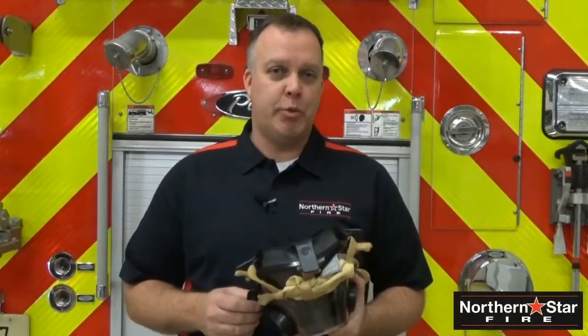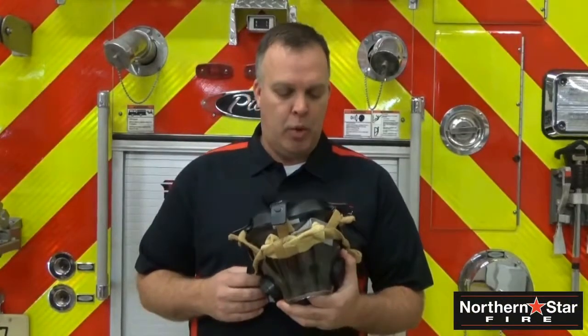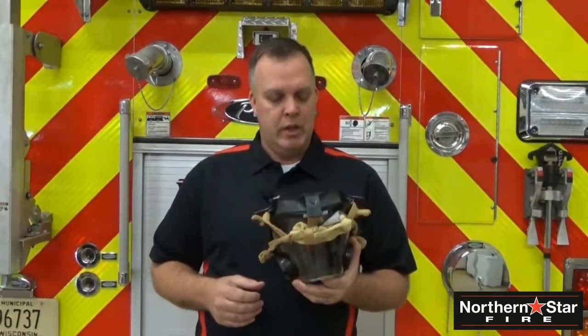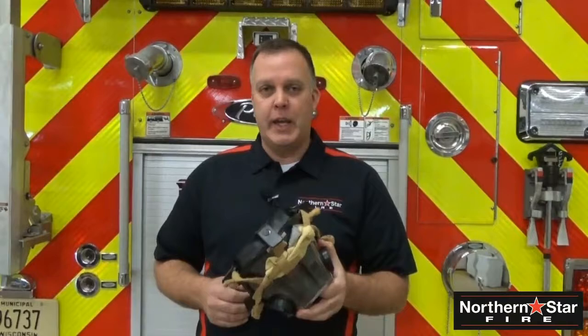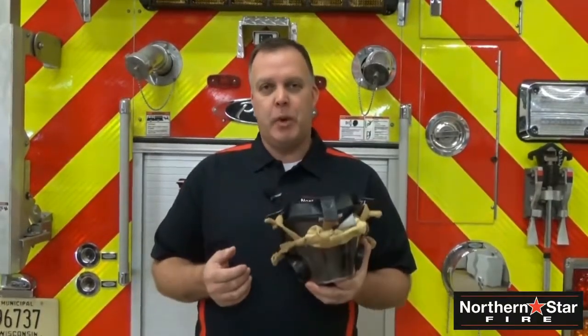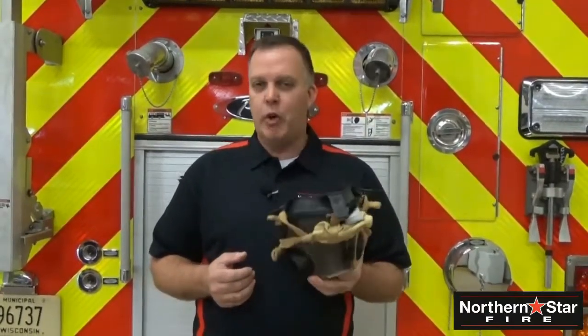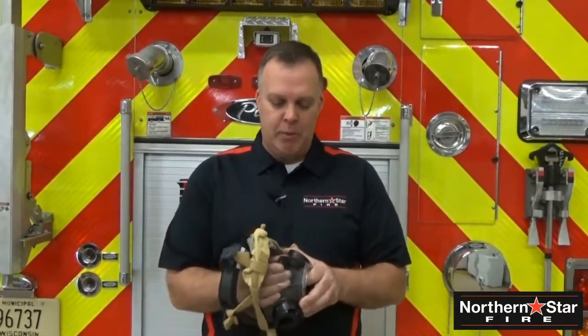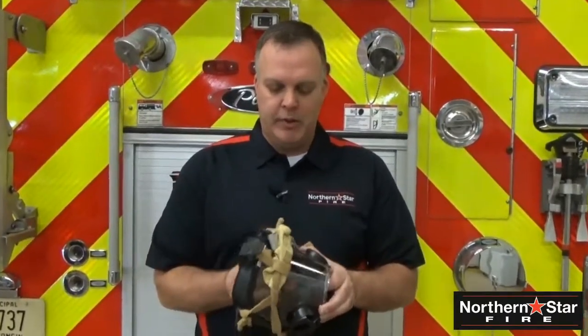Hi everyone, Jeff Dykes with Northern Star Fire, talking to you about the waterproofness of the Northern Star and how we go about cleaning our mask. So the easiest way to clean your mask is to go with your regular manufacturer's recommendations. If you're one of those departments that actually dunk their mask into a bucket of water, while the Northern Star is waterproof, we still recommend that you go ahead and remove the top housing, which is very simple.